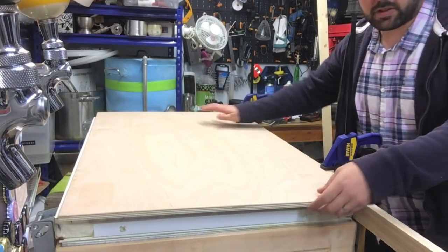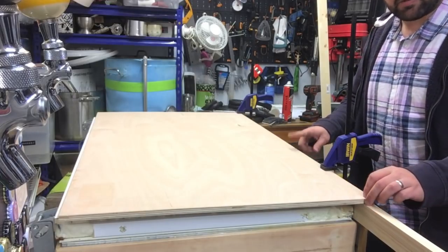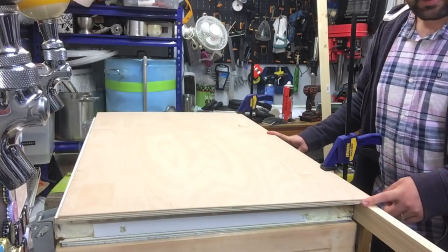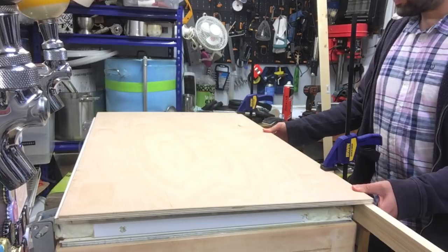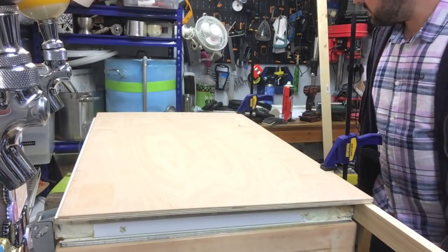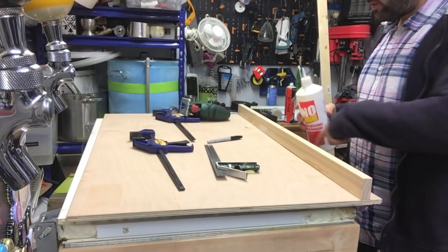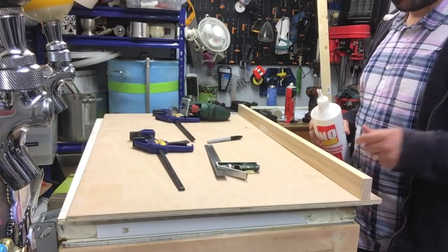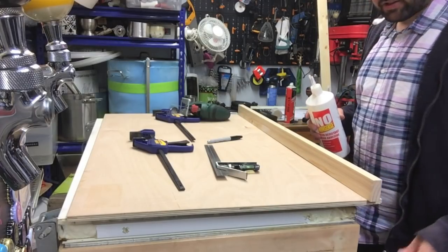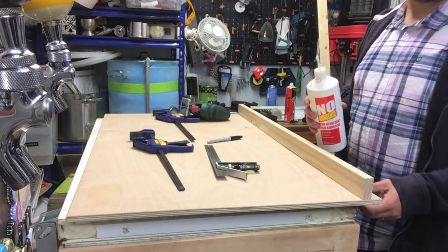I've cut the top sheet down to give myself basically about 22mm, just over, of clearance on the two sides and at the front. I've already clamped the strip wood onto the front so I can measure and cut it, and once I've done that I'll do the two sides — glue and then screw them into place. That's going to provide a nice rigid frame around the outside of the top. Good old-fashioned wood glue going on in a bead along the top here, then I'll drill through and reinforce it with a few screws. No need for fancy joints since it's all going to be covered by the cladding — just butted up against each other with a couple of screws through the end.